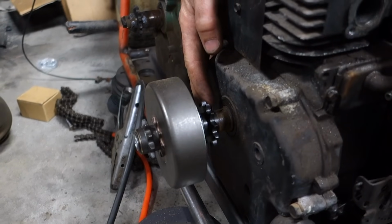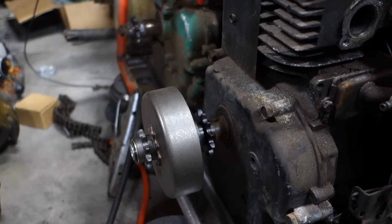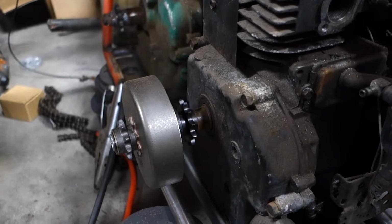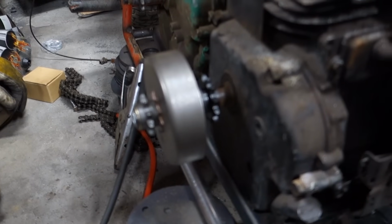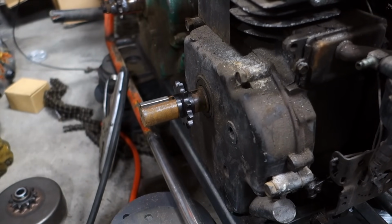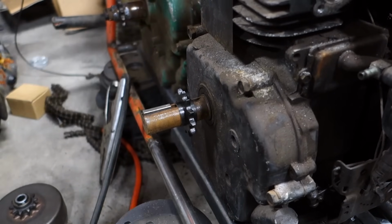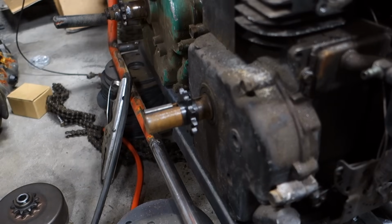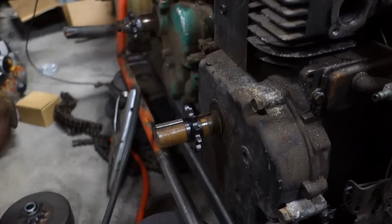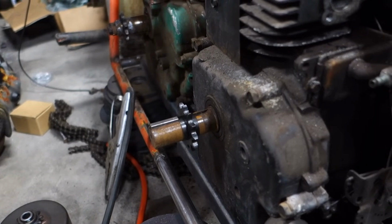We're gonna weld this one up to the back of that clutch. That one's gonna be funky, dude, because you gotta make sure none of that weld interferes with the sprocket. What about taking a file and just putting a keyway on there? File a keyway, and just let that sprocket float? It might float this way. Put another collar on it. Another collar. If it breaks, then it doesn't.